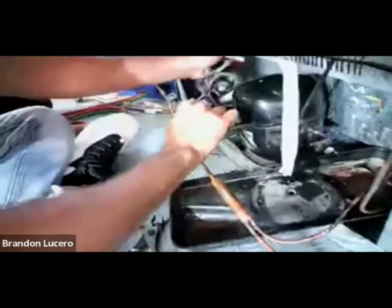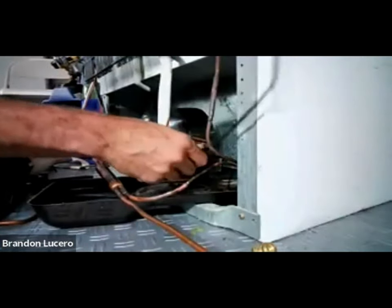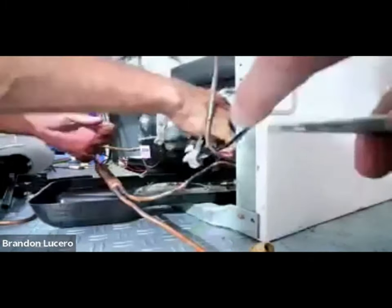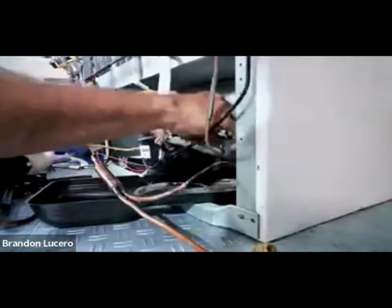You can always add a little bit of pipe on your suction line or your discharge line. Sometimes you have to cut a piece off to make the system fit the way you want. What he's doing is using a tubing bender to bend his discharge line so it'll fit that piece he just made. There's another question - let me see. It's hard to see from here.